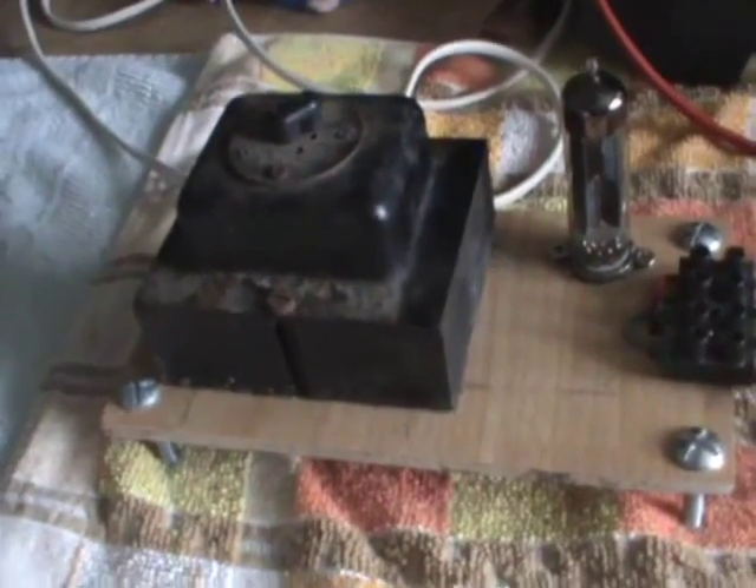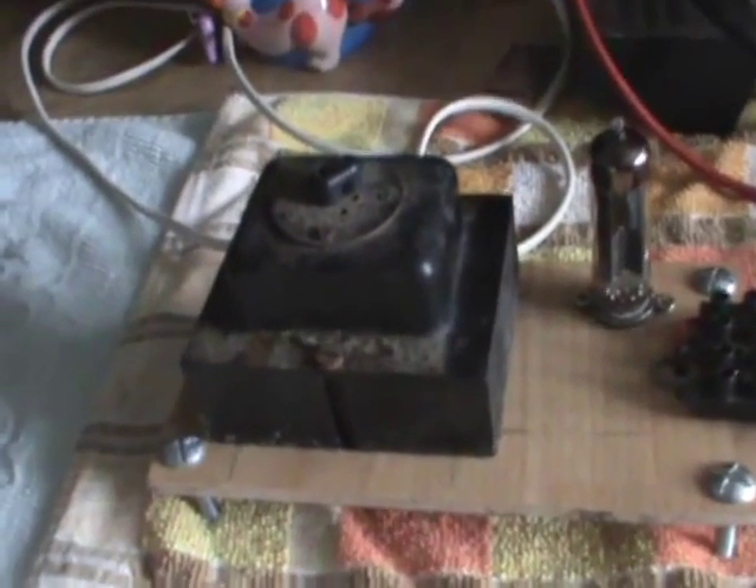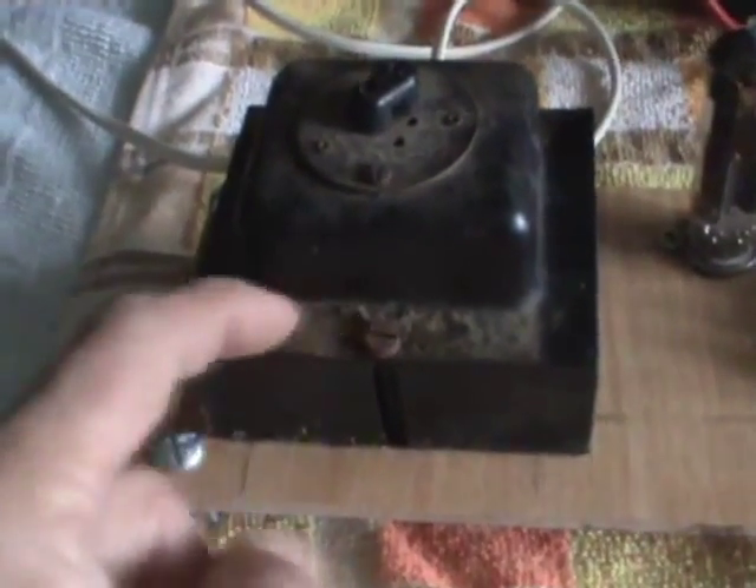That's one EL-84, one ECC-83, working as a mono amplifier, driving one single EL-84 into its own matching audio transformer — times two, so the whole thing is stereo. And also, in the future, I'd like to have two separate power supplies; at the moment we're just going to be using the Decker PSU, but it's still filthy, as you can see.